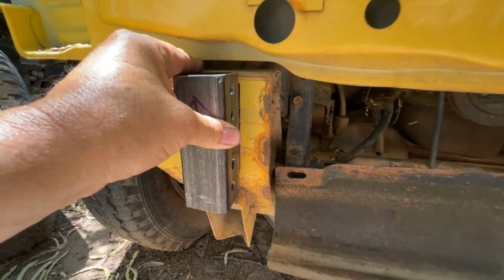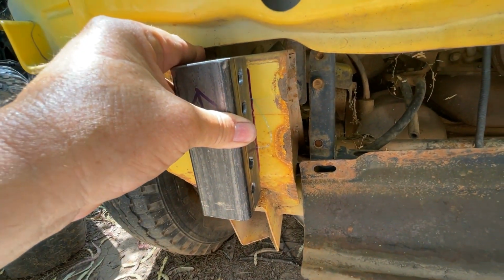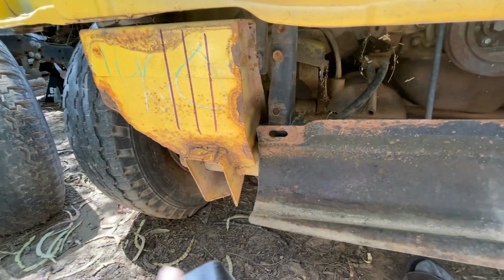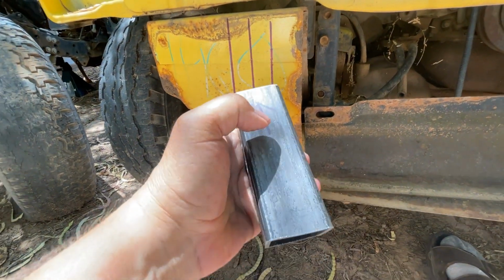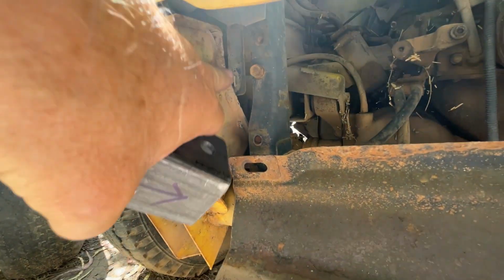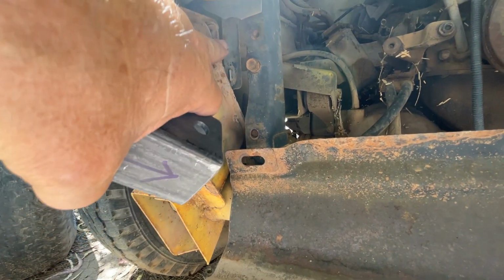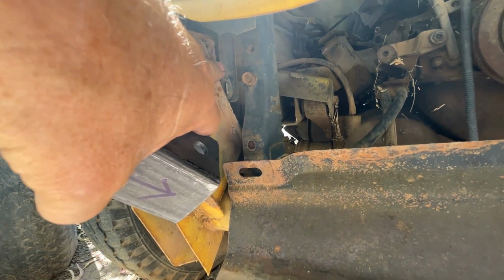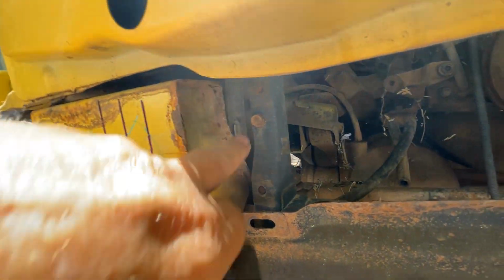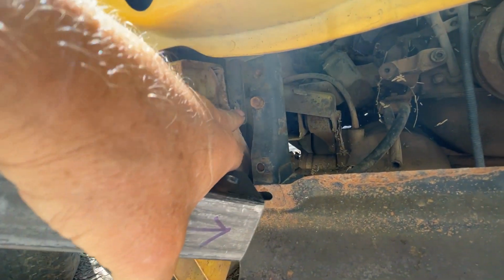You know, earlier or in other videos, we talked about this. You can bolt this, okay? You can drill a hole, say here, and maybe here, an inch or so apart. And it'll drill through this shoulder, or whatever you want to call it, the end of this frame right here. And actually, this is just a big support mount. It just supports your fender and your grill and your cross members and those things, okay? But you can drill through it, a couple of them.